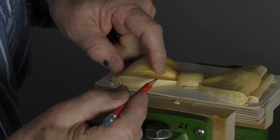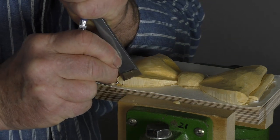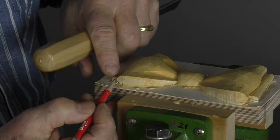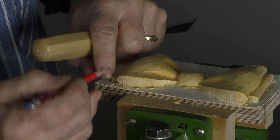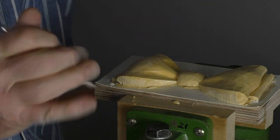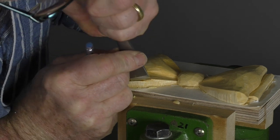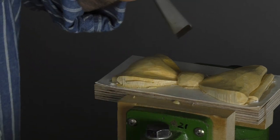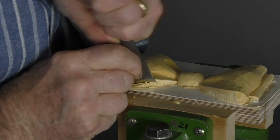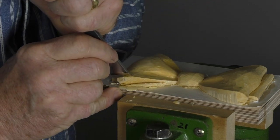Turning to the top side of the bow here, again I should have this edge shaped, so this edge is a finished edge along here, set in there. Here is the end of the bow coming round, but in this case we don't have to create any sort of backing really, because this will be up against the collar, so we can just undercut a lot of that like this. Just come down about 30, 40 degrees, something like this.